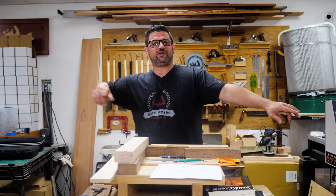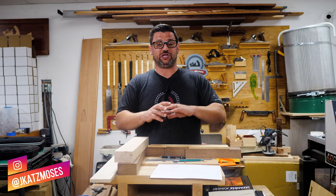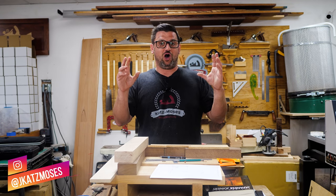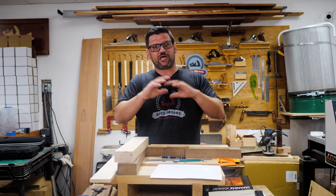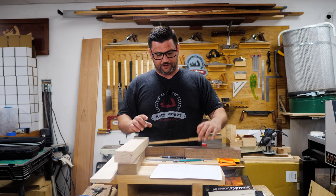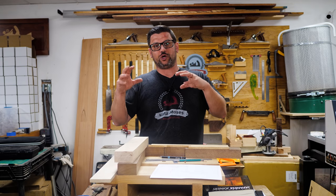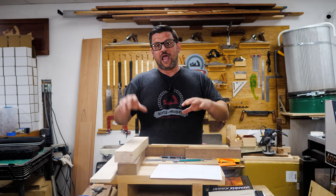On this week's joint of the week we're going to do the scarf joint, which is such a great joint. It's used in everything from large timber framing applications to small decorative beams in furniture. There are about 15 different ways to do a scarf joint. We're going to do one that's really fun — a wedged mortise and tenon scarf joint with two wedges in the middle that bring the joint tight.